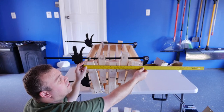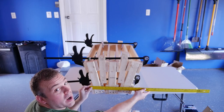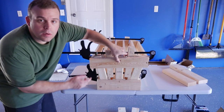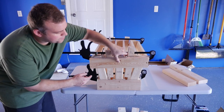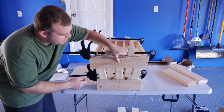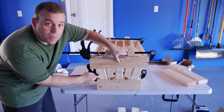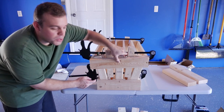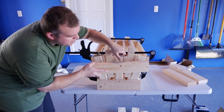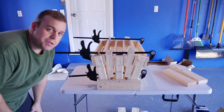A 17-inch piece of 2x4 across the top should be plenty for me. Along the bottom, widest point to widest point is about 13½ inches, so that's the wood I'm going to cut. Now that I've got my 2x4s cut, I go ahead and put one on the top and one on the bottom — the bigger one goes on top, the smaller one on the bottom. Take two screws, sink them in through the 2x4s and into the 2x3 wood that makes up the frame holding the tubes. Go ahead and pre-drill before you do that. I usually start with the bottom since I find it a little easier.